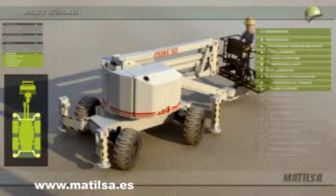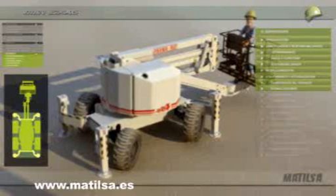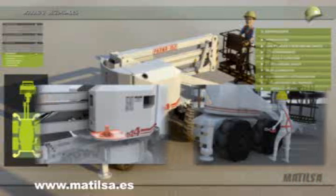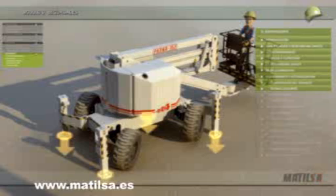It is recommended that all the machines for outdoor work have them as a safety feature for when their use is necessary. If they do not have them, failure of the tilting device or negligence on the part of the worker when bypassing the signal will enable them to raise the basket without its being properly stabilized, and this may cause serious falls. Before elevating the platform, you should make sure that the stabilizers are creating a force against the floor and over the surface with the correct resistance.